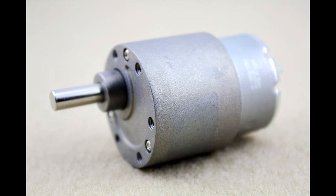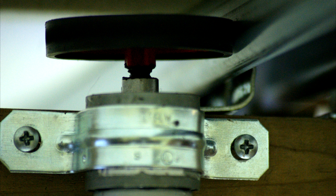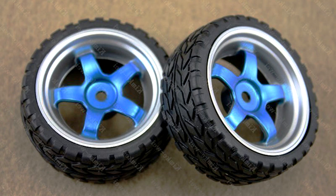Now let's talk about the motor. I purchased this one off eBay for $15 because they were in the US — you can buy them from Hong Kong and other places in China for around $8 with free shipping. I'll provide a link to an eBay seller in the description. To attach this motor to my piece of wood, I used a piece of conduit strapping purchased from Home Depot for about $2 — it's a 1 and 1/4 inch which is just shy of the dimension of the upper gearbox of this motor. Now it's time to attach your wheel to your motor. I used a K'nex wheel which had a 6mm hole and used glue to attach it to the shaft. The eBay seller I mentioned also provides a 6mm coupling and a set of wheels you can use to attach your wheel to your motor, although it does add cost.